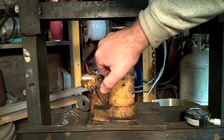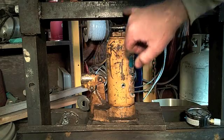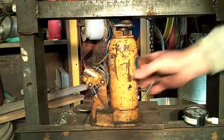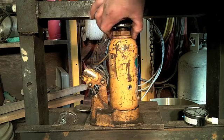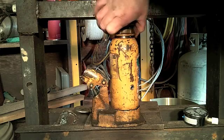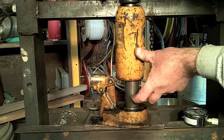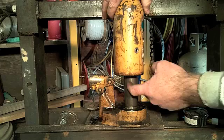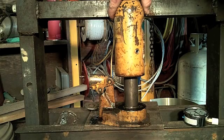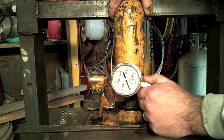Put the base in the vise, big pipe wrench, big channel locks, big something. If you're going to take this down, go ahead and unscrew this. Once you get this out, the piston assembly should lift out of it. This is the hydraulic fluid reservoir, and that comes off next. It took a very large pipe wrench and quite a bit of force to break it loose, but it came. This is the next piece of pipe that has to unscrew — this is the actual barrel for the piston. When you get that apart, you're going to want to carefully measure the inside diameter so that you know just how big it is. It'll let you calculate the surface area and figure out what sort of formula you're going to need to get your gauge accurate.